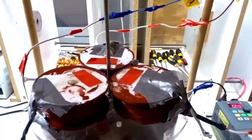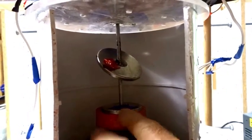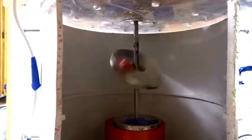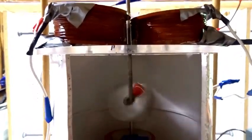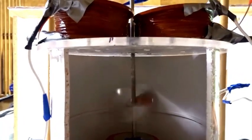Now let's try another way of doing the same experiment. We have three coils U, V, W wired up to our variable frequency device, and down here we have the magnet that's going to wobble — 60mm — just holding it up with another little 50mm magnet so it doesn't fall down to get it in the right position. We turn on the three-phase power, it starts spinning, and if it was magnetic repulsion pushing it up in the other orientation, we would expect this magnet to go down as it spins. Instead, it rises like a top as it gets spin angular momentum.